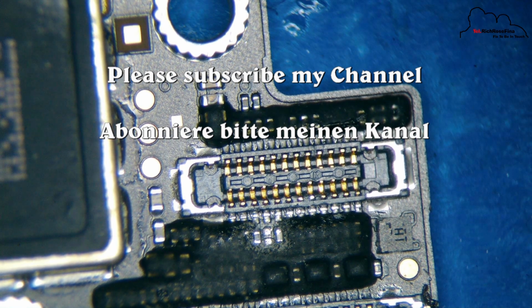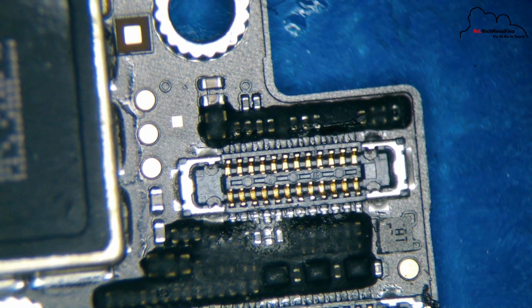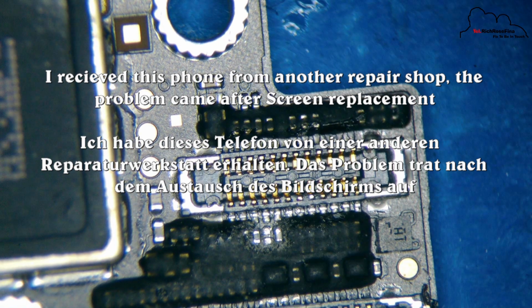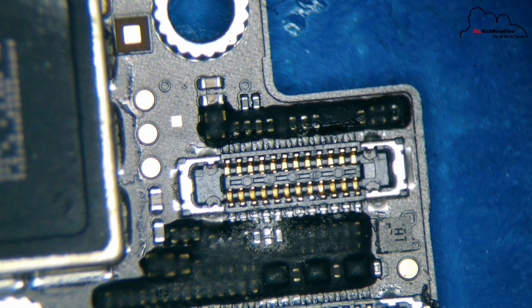Normally, you say, check the connector on the main board. J5800, basically, is the touch problem connector. The problem comes, in case you are connected, the flex cable from the display side, which is the backlight, and the touch ID, and the home button, you connect here.